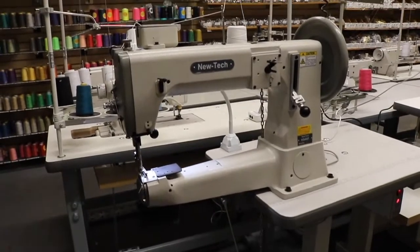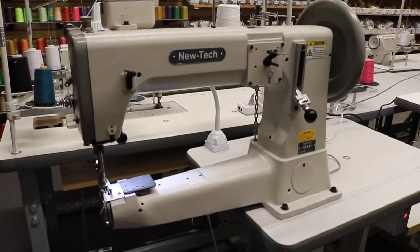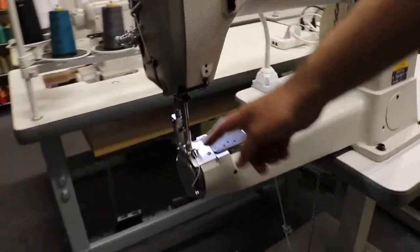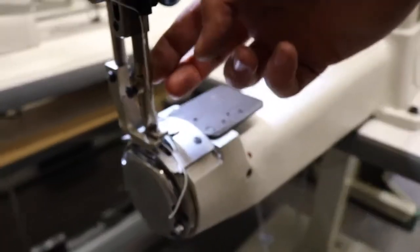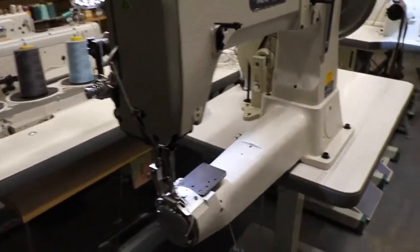You could already see that the one on the left, the HA441, is much bigger. It's also made by Juki and by Cowboy Company. It's a huge machine for saddle makers — the feet, the plate, the needle — size 29 needle. It's all for saddle makers and luggage makers.